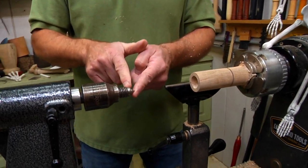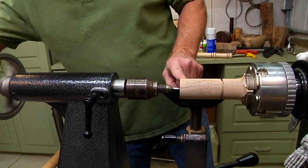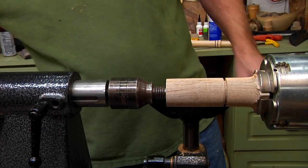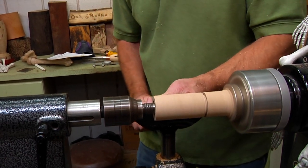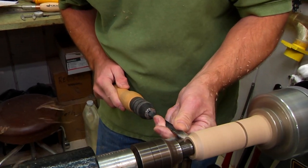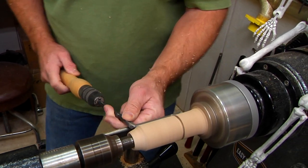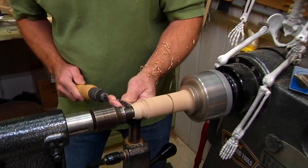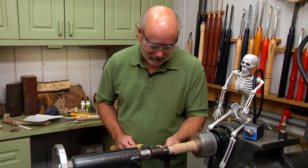On the Robust live center I've extended the tip a little bit. This is really important, especially when you get into the longer pieces — you want some support there. Now this is going to poke a hole in here, but I'm not worried because we're going to poke a hole in there later when we drill to put the wire in. So you bring this up, thin the wood down to where it's close to that edge, and that will tell me the diameter of my fingertip at this point. From this point forward, all the fingers are exactly the same — wash, rinse, and repeat. Just make sure you've got your measurements and stay consistent.